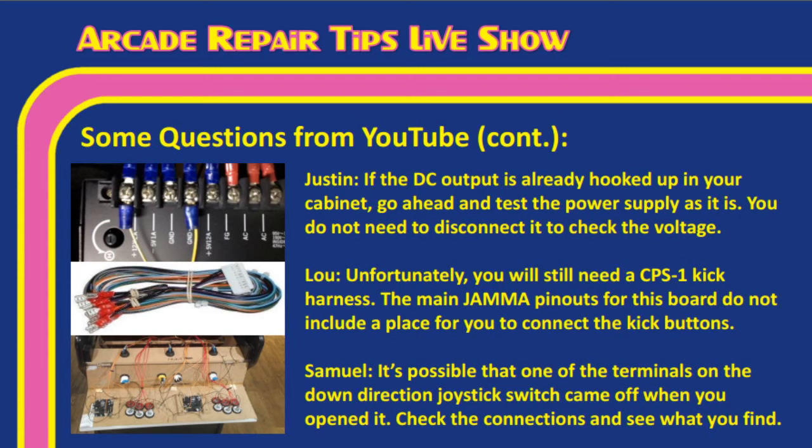Lou, unfortunately, you will still need a CPS1 kick harness. The main JAMMA pinout for this board does not include a place for you to connect the kick buttons. So like I mentioned, no kick harness, no kick. So you got to have the kick harness on there in order to get those. So even the nicest JAMMA harness on a CPS1 game, you're still going to need the kick harness to do that.